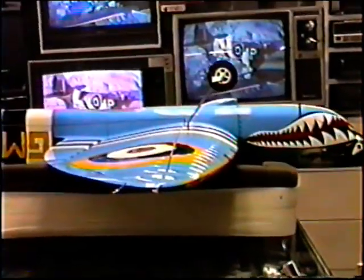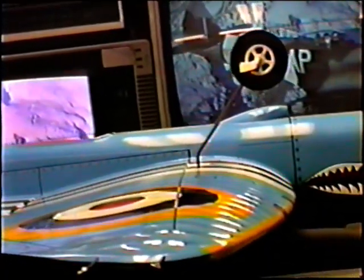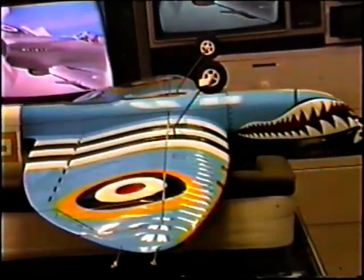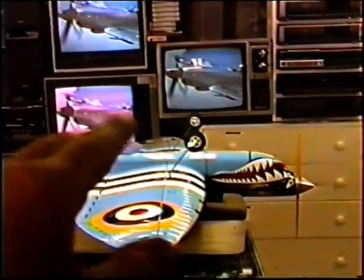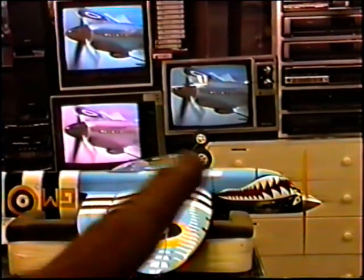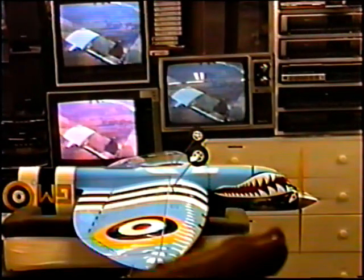Now notice we have them both bent forward. Both of those wires are almost identical. And that's the key thing. Now the next step here is to put the little doors back in and see if we have that rocking action that we want. When we get that just right, and by going a little bit further forward each time, we'll find a spot at which it just balances in.